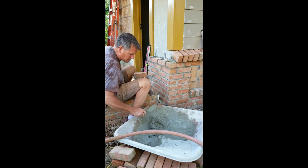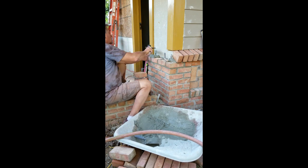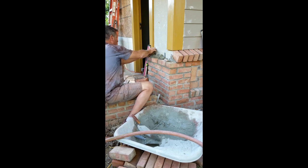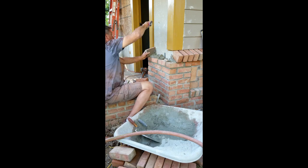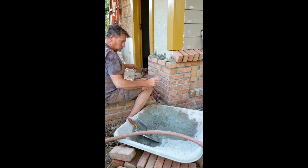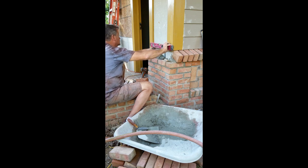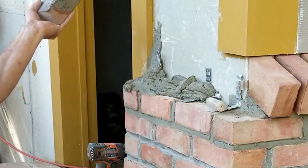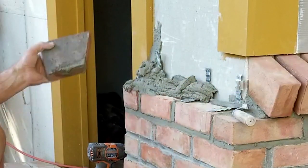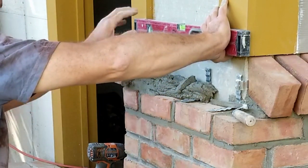That's my mortar pan. Doing this kind of custom, decorative brickwork, I try not to force myself to use mortar faster than I'm really able to. I keep dry, putting in about half a bag at a time but mixing only a few bricks' worth at a time. Here I'm leveling from the top of the brick to the bottom of that corner board - that's the line.